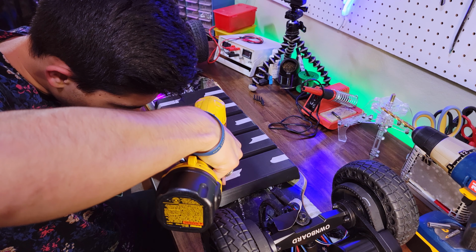Alright, so I got my epoxy mixed up, and I've got a couple inserts installed that I did just ahead to make sure it was going to go smoothly, and now it's time to actually install them. So what you're going to want to do is get your drill ready, and I'm going to make this little assembly. This assembly that I make is just an extra long screw of the same exact threading. I think this is an M4 by 30.